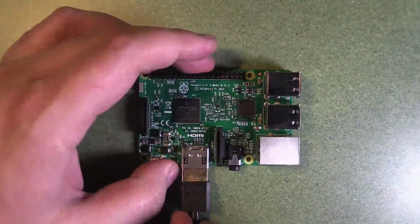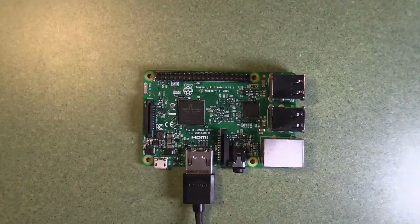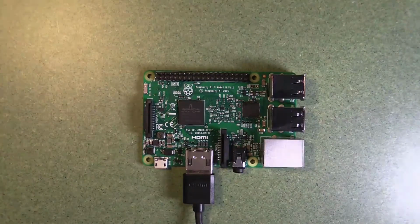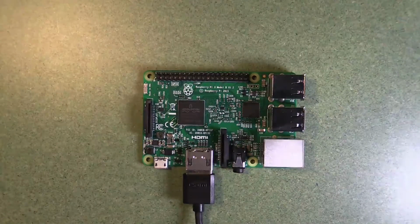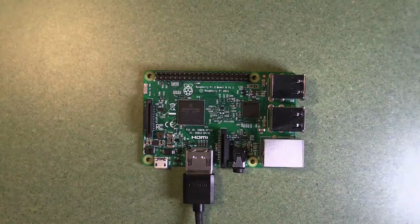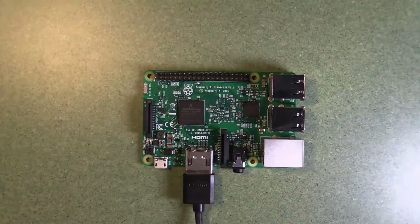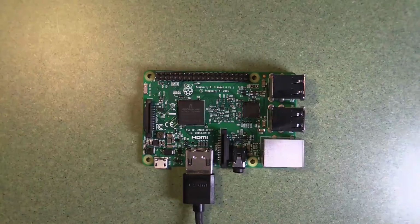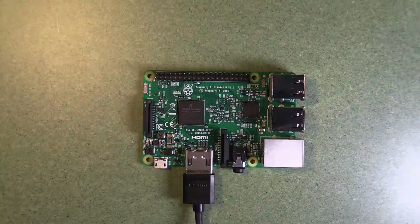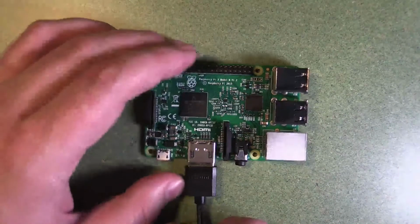The second way that is pretty capable is using HDMI audio. So you can connect an HDMI cable to your audio system, and that can go into your hi-fi or to your TV, or indeed to some larger systems that take HDMI digital audio out of the Raspberry Pi. And this is also not particularly difficult to set up, because Raspberry Pi provides the Raspberry Pi config utility to select HDMI audio. Now, one trick is that sometimes you'll be trying to use the mini jack audio and the Raspberry Pi will be set to send audio out of the HDMI port, but it doesn't tell you that. It just does it, and you think there's no sound coming out, but it's actually coming out the wrong place. So those are two simple ways to get audio out of the Raspberry Pi.